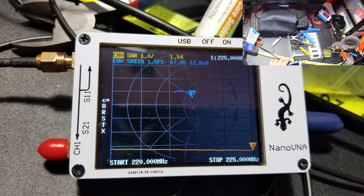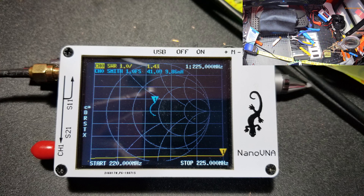In the final section, I captured some still images and video footage where I attached the Nano VNA and did some quick testing for the 1.25 meter spectrum. The initial spot I found on the wires showed 1.54 SWR at the 225 part of the band. After making some adjustments, the worst part of the band was 1.43, and it was a little better on the lower parts of the band. That's why you want to cut that little gap — just take a minute, play with it, find the best spot. If you really wanted to spend time tweaking, you could probably get things down to 1.1, but these are pretty decent numbers without obsessing over every little cut and measurement.